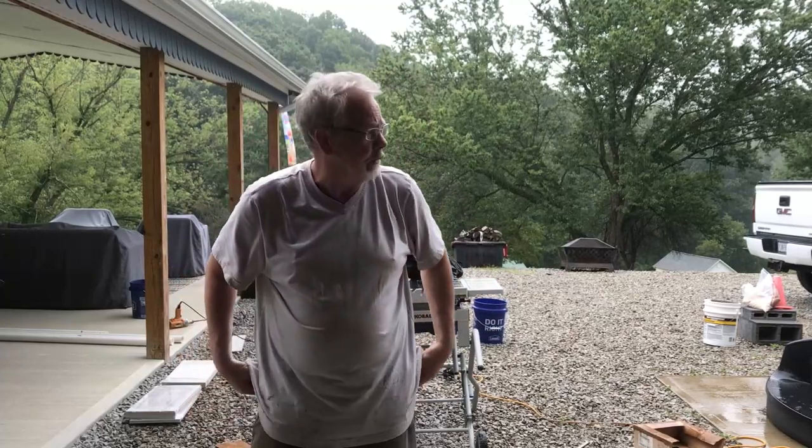Now, we were able to go a little thicker in some areas with our thin set in order to make up for the unevenness of the floor. Naturally, going with a smaller floor tile was a lot more forgiving on those areas. So I don't think we'll ever have any issues with any cracking or the grout popping.